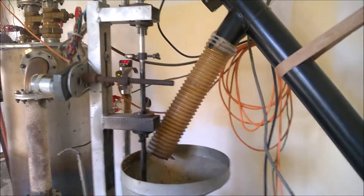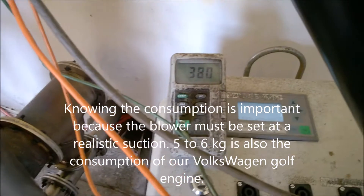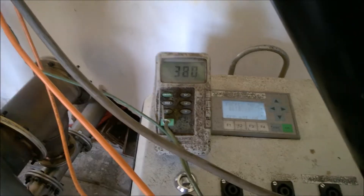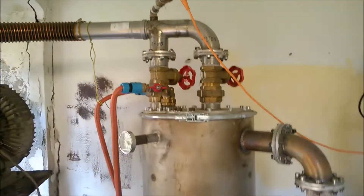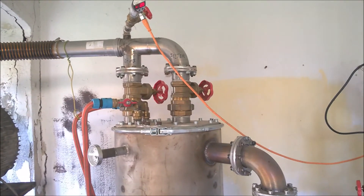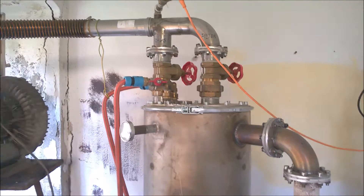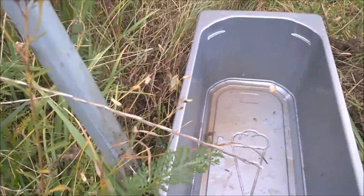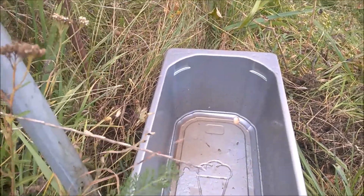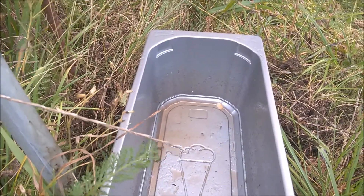All is done using standard fuel pellets. I consume about five to six kilos an hour. Temperature is fluctuating between 350 and 450 degrees. I'm doing this test with a blower to represent the engine. Next to the blower I have a filter condenser, but I don't use the filter — I make this test to get a neutral view from the gasifier only with the function of cooling, to see if the gas is clean. I have here a sample of the color of the condensate — the normal apple juice color. So I can say there is no tar whatsoever in this gas.